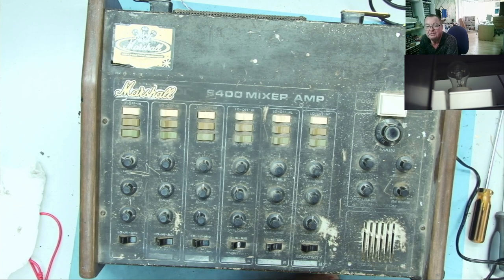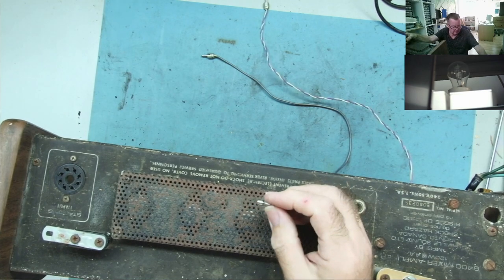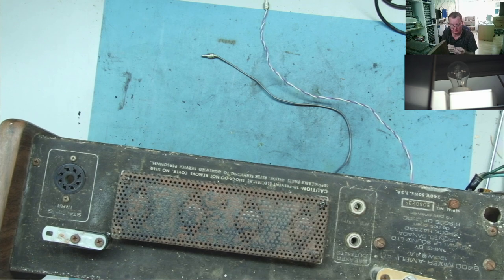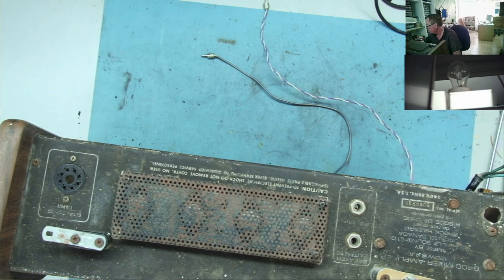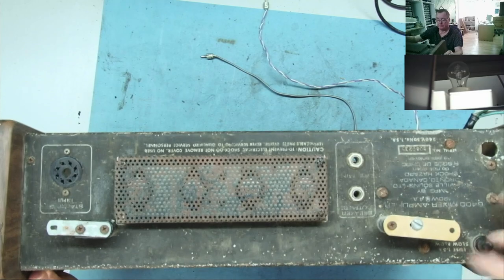Before I do, I better put the fuse in. I have a 1.6 amp slow blow, that's close enough to the 1.5, I think. Just unplug the power again for a moment to be sure, although it was switched off at the switch. Fuse. Okay, fuse. Right.